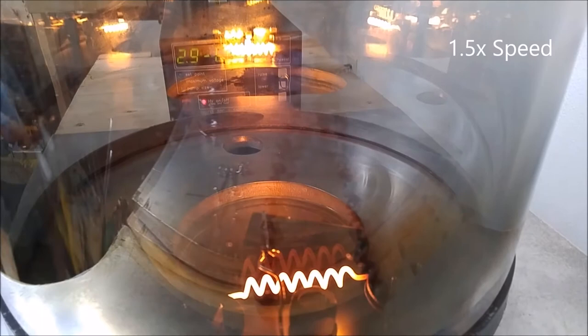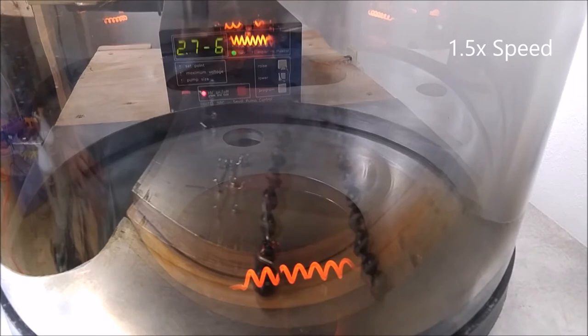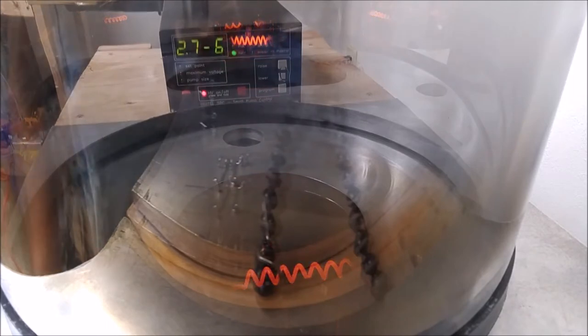Just as the pressure increased when the filament heated up, as it cools back down, there's less water vapor coming off the filament and the nearby vacuum chamber surfaces, making the pressure fall slightly lower. Like I said, at some point we've got to clean this titanium off. To do this, I found that a Dremel with a buffing wheel attachment does a great job, and I'm just using regular toothpaste as an abrasive. Squeaky clean. After this, I went over the bell jar one more time with acetone.